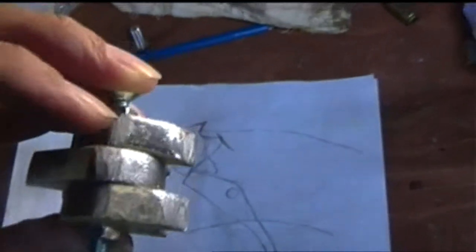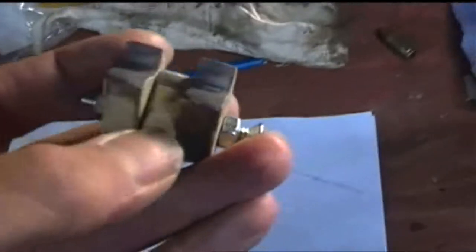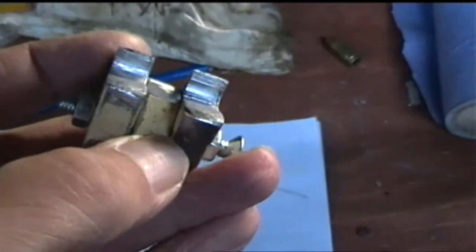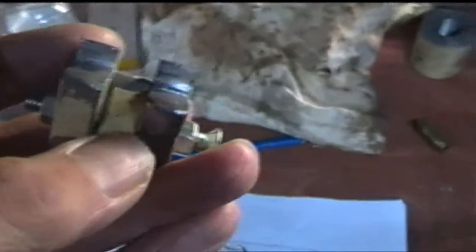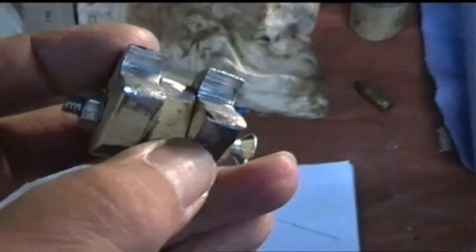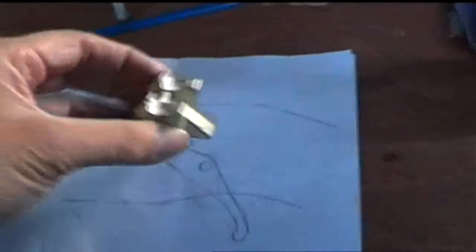You know, I could make a groove in these points here, and then I can weld them up. Then I can flip it over, and then inside that point there, I can weld it on its two sides. I can also put the grinder down in again and get in there again, but there's no real particular issue here. I can just weld that area up, so that's quite easy to do. So that's what I'm going to be getting on with next.